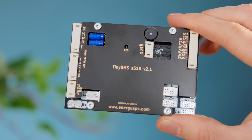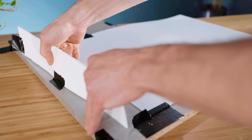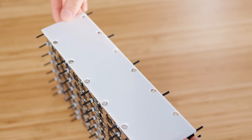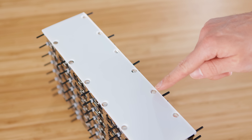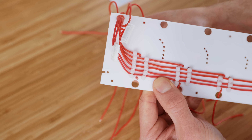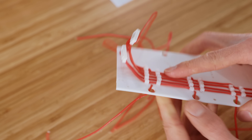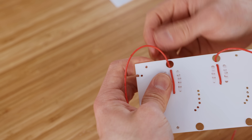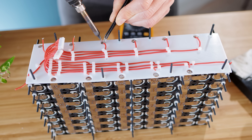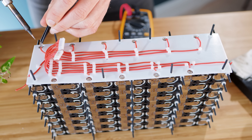Before connecting the BMS to the battery, we're going to do this to a high level of safety. The first thing needed is a sheet of insulating plastic — I've got some PTFE here, which is a thermoplastic that has a very high melting point and also makes for an excellent electrical insulator. I've made some holes in this piece that line up with the balancing tabs on the battery, which allow the BMS balancing leads to be routed to the tabs in a nice neat and ordered way. I took extra care to make sure they can never touch each other, thanks to plenty of cable ties and a few holes here and there to thread the wires through. Round the back this is just really good practice — it's not only safer but makes it easier to wire up as everything is laid out clearly and can be checked by eye.